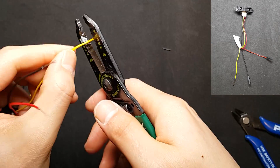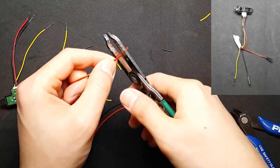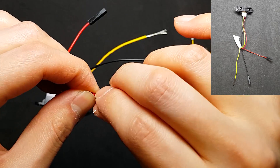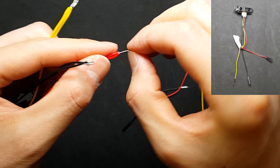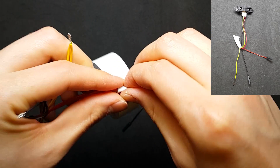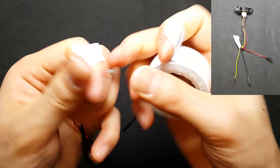This sensor is an infrared sensor. The sensor uses 3 wires. In order to read distance from an object, the Arduino needs to read an analog input from this sensor. We are going to use pin A7 for obtaining the sensor value. Finishing with tape.